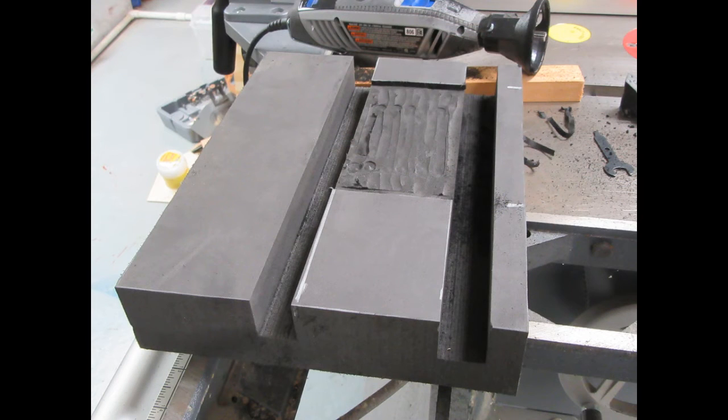Here's the foam block that will fit on the end of the case to support the flat of the bell rim. It has been sawn to clear the two handle support rails and milled with a Dremel tool to clear the handle assembly itself. There are many good surfaces here for the adhesive to work with. Some of my cut lines are visible in this photo. Due to the darker gray color of the foam, I use a Sharpie marker having a fine point and metallic silver color for good contrast.